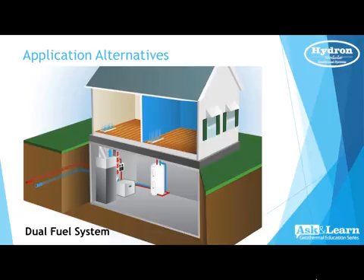Let's touch on the two geothermal split system configurations. An outdoor split is used when there's no room inside the house, while an indoor split can sit in the basement or an adjacent closet. A split is basically the same as a package unit but with the components separated. The outdoor unit — the geothermal heat pump section — can sit outside, doesn't need any air source, and can even be covered up or have a deck built around it.